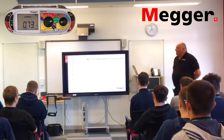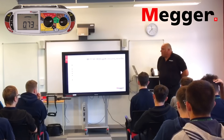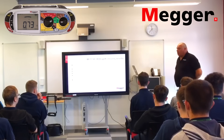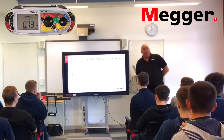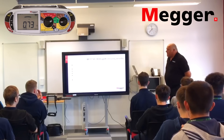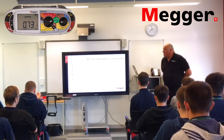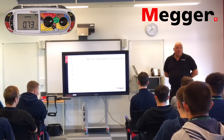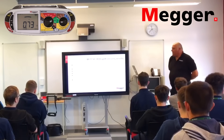The RCD uplift immunity benefits: complete immunity to the effects. No need to bridge out or short-circuit the RCDs and RCBOs. No need to measure RCD input and output impedance. There's no need for post-measurements and calculations, so you don't need to adjust any measured values. And there's no need to add any comments on a schedule of test documentation.